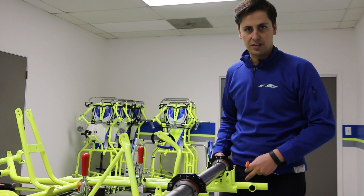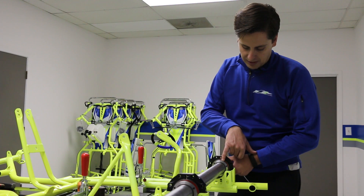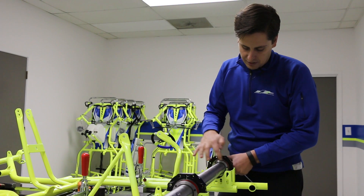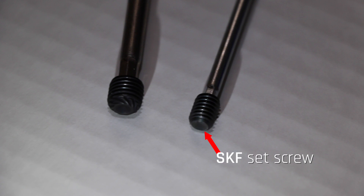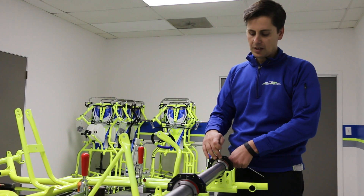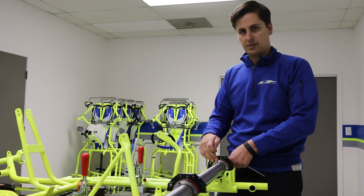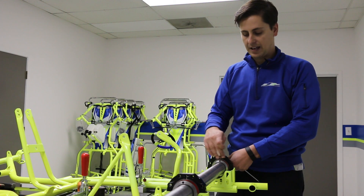You're going to have your inner locking ring. With the set screws loose, it's just going to spin freely around that clamping collet. There's a little slit mark in between the clamping collet — when we tighten this outer ring down, that's going to clamp down on the axle so it doesn't move. You're going to have three set screws. It's important to use the set screws that come with this locking clamp from SKF, because they actually have a flat end on the backside — they're not knurled like a typical set screw. If you lose a set screw and replace it with a knurled set screw, that throws off the balance of this locking collar and that's what's going to have your axle shift. So make sure you're using the SKF flat-end, non-knurled set screws.